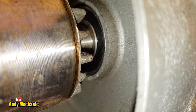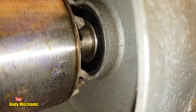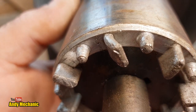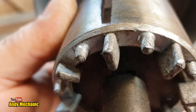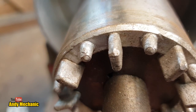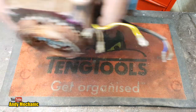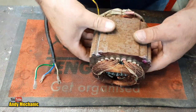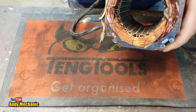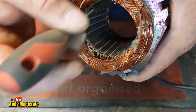The bearing feels really good though, and so does the end bearing, but maybe a foreign body got inside the air compressor. And you'll see that on the other end as well. So there you go, look, that one's bent. That one's bent the other way a little bit. That's pretty straight, pretty straight, damaged again. Yeah, definitely been something going on inside that motor. Not good. Right, let's take a sneaky peek at the field windings. Actually pretty heavy. Okay, so if that fan had crashed into or made contact with the field windings, we would see damage somewhere around this area here.